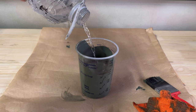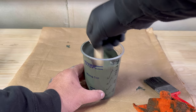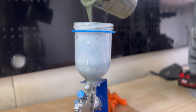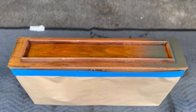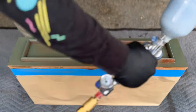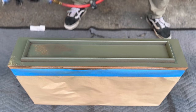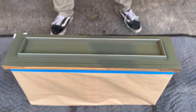This paint is actually a new paint that I'm using and I'm trying to use it more moving forward because it keeps me from having to use a top coat over it. This is a cabinet coat made by — I think it's called Inselex — I get it from Benjamin Moore, and it's an acrylic enamel based paint that doesn't require polyurethane over top of it. It dries really really hard and it's meant for kitchen cabinets and heavy traffic areas. They say you can get away with two coats but I do three, and you don't need primer or anything for it, so it saves a ton of time.